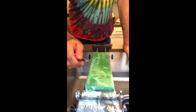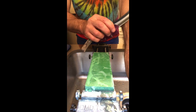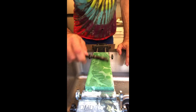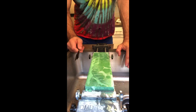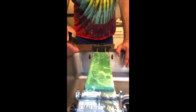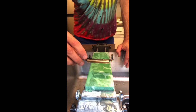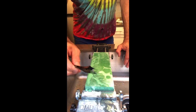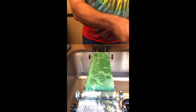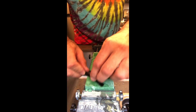What I'm going to do is kill the blade, kill the edge. I know a lot of people give me a hard time about that, but this thing does shave arm hair. Here's the thing: if I didn't kill the edge and I ran it and tested it to see if it would still shave arm hair, well yeah, of course it would. But my question at that point would be — is it the new edge I put on there that did it, or the one that was still existing? Because I don't know how many layers of tape — I have one layer of tape on there. What if they used three layers? I'm not going to know if I'm there if I didn't kill the edge first. So very lightly, just kill that. It's not cutting anything now. So when that gets back to the point that it cuts my arm hair again, I'll know that I put it on there.